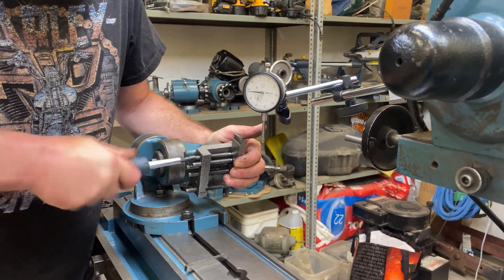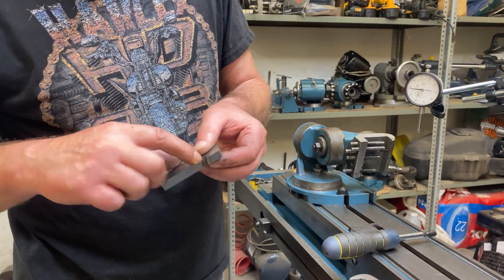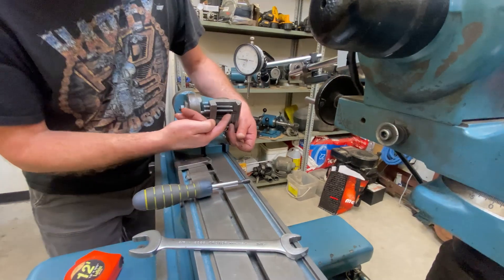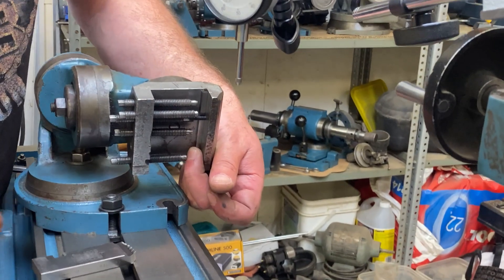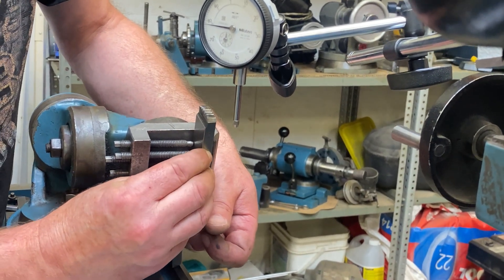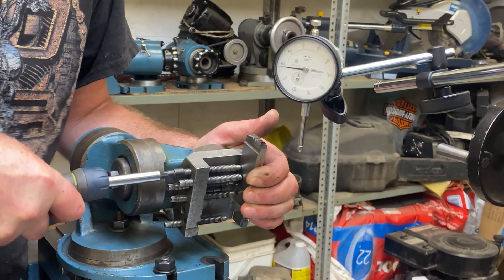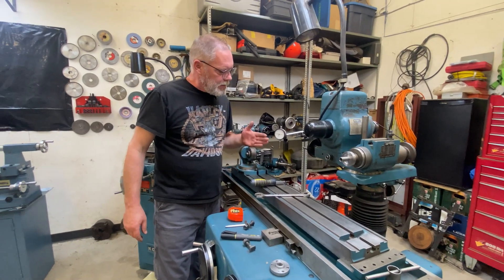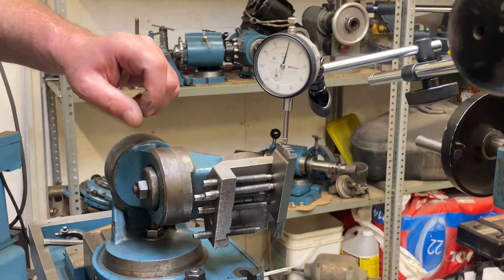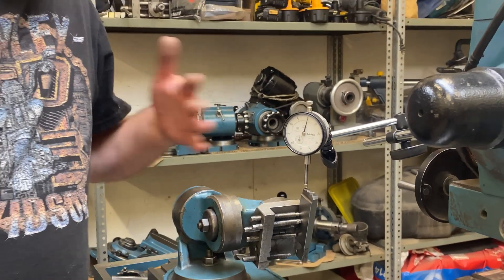Let me show you what I have going on here as far as the setup goes. When these are in the machine, they each have this cutaway slot in them and that's what keeps all four of them exactly the same distance from the workpiece as each other. I've got a bolt in here fastened nice and tight. I'm going to put that cutaway slot in the tool over the bolt and come all the way down - this will ensure that whatever I do to one die, I do exactly the identical thing to the other dies. I've got my fixture dialed in so I know it's going to track properly across the clearance area, and I've also got this lead-in angle dialed in - you can see I'm perfectly on zero. Now I'm going to put a wheel up here, put the radius on the wheel, get everything aligned, and then we can start going.